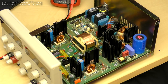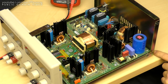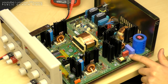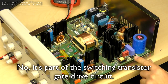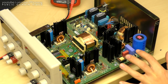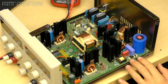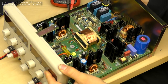All right, and here's the inside of the power supply, and in it I found a tiny piece of plastic flapping around, and closer inspection reveals a hole in this transistor, which I believe is a part of the PFC circuit from a cursory glance of a schematic. And there's just bits and pieces ruined all over this section, just like this thing's done once before, and it was a royal pain to fix, so I'm hoping we're gonna get by easier this time.